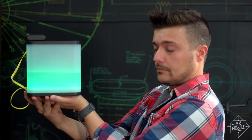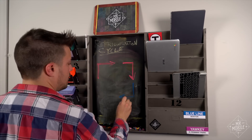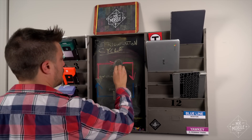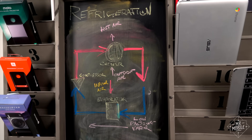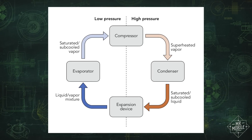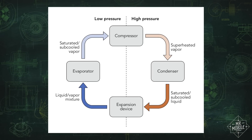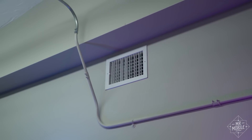The whole notion of a personal air conditioner is a little absurd. In cities like Boston, air conditioning works through something called a refrigeration cycle. And since this diagram I drew is not very good, let's just use the one from the internet that I found. Air is passed over pipes containing a chemical refrigerant. This process also condenses water vapor, which is discarded, so the resulting air is not just cold, but dry.